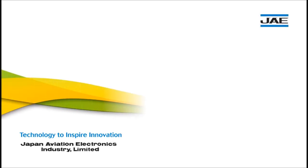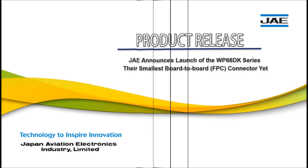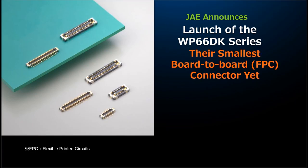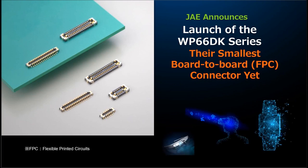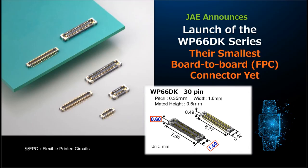Introducing Japan Aviation Electronics Industries product release. JAE has launched the WP66DK series stacking type board-to-board connectors that are ideal for use in wearable devices. It is an ultra-compact connector with power supply terminals, a 0.35 mm terminal pitch, 1.6 mm width, and 0.6 mm mated height.